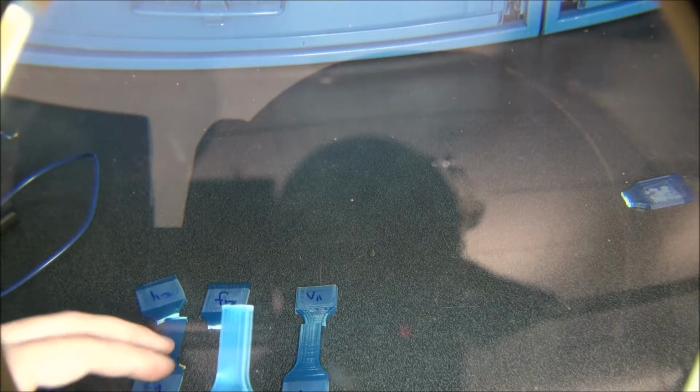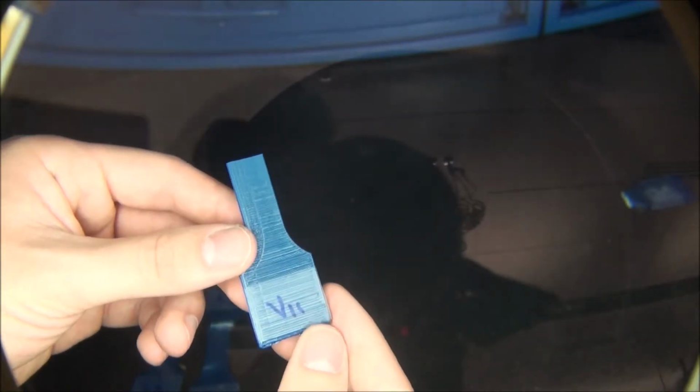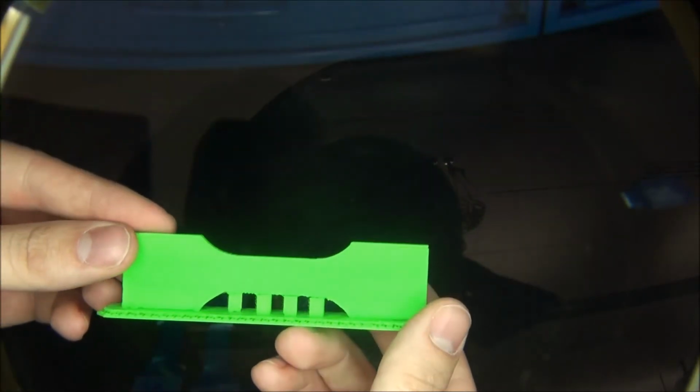We actually did some further testing where we smoothed them. You can see on this piece there's a shiny part. What we did was take some acetone vapor, we boiled acetone and dipped the piece in there for a little bit and brought it back out. The little bit of acetone vapor was able to smooth it. This didn't increase the strength, but it increased the reliability. It reduced the standard deviation. So it helps the layer-to-layer bonds, and it showed the most change in the vertical samples when we smoothed them. That will help, but the best idea is to assume that you're going to have a 2,000 psi orientation. No matter what part you print, every part's going to have that weakness. So if you pull this part apart like this, it's about 2,000 psi.